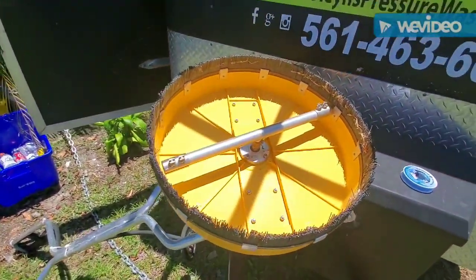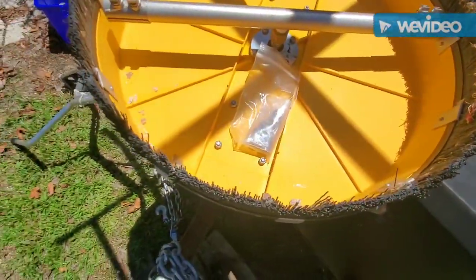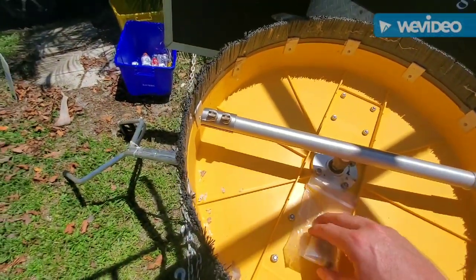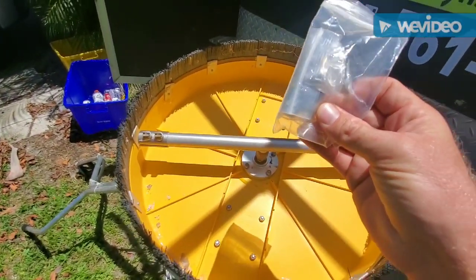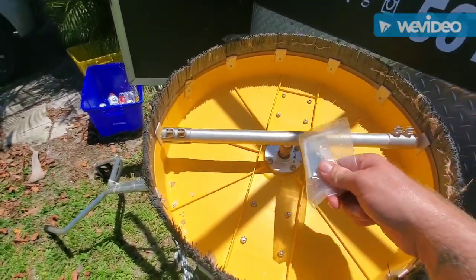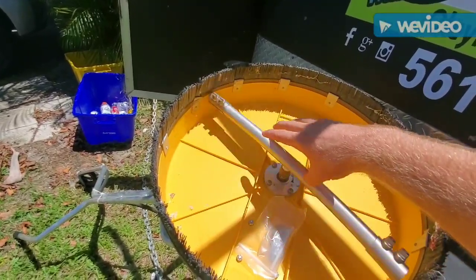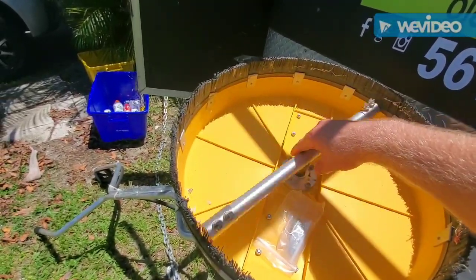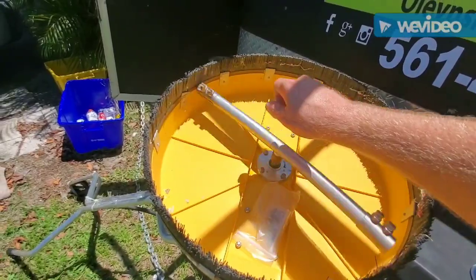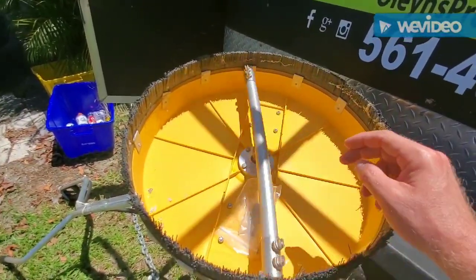Well, you don't need to get the four-tip bar, but I did and I'll explain what I did. You can put four tips in — these are 2502s. I use this for my 8.5 gallon per minute machine. I'm actually going to be upgrading these to 2503s, which means 12 gallons per minute total. I go with bigger flow because my machine with a bucket test goes close to 10 GPM. With 2503s I want more flow and less pressure, so pressure will be around 2000 PSI out of each nozzle.